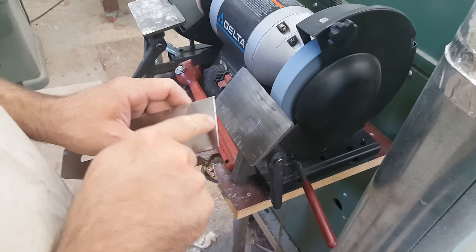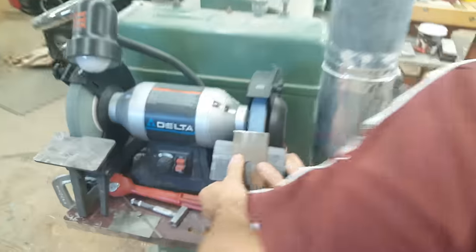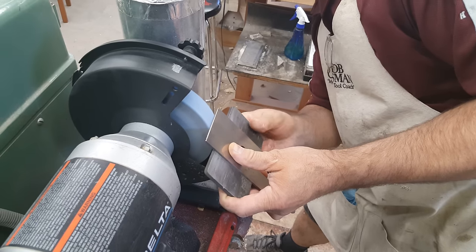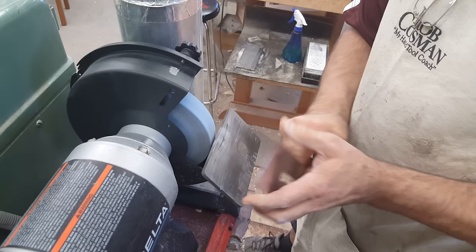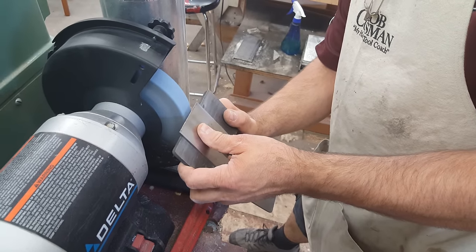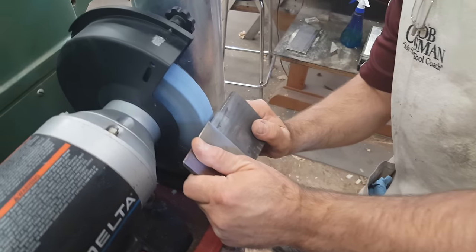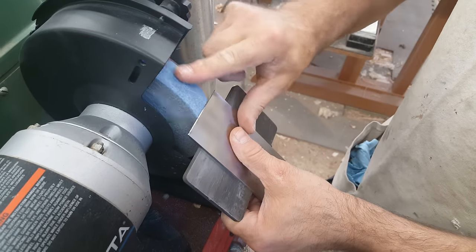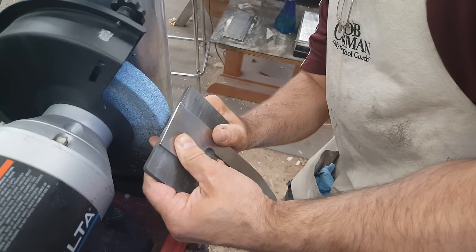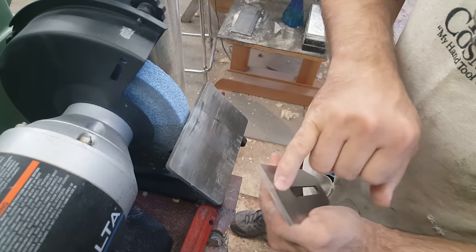This is actually a high-angle blade that I made — that's why there's a really pronounced back bevel on the back, but I still need to get this cleaned up. I go in and I eyeball it until the blade touches the grinding wheel at close to the same angle that I had on there. You want to be hitting about in the middle — I'm hitting down at the bottom, so I need to bring that down just a little bit. Spin it by hand and see where it's making contact. It still needs to come down a little bit more. There's my contact right there, and that's good.